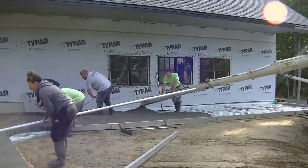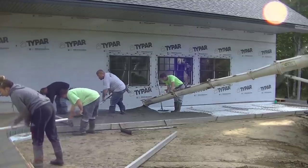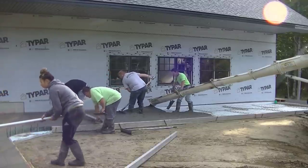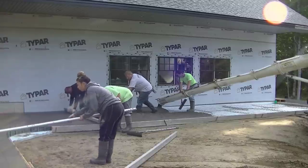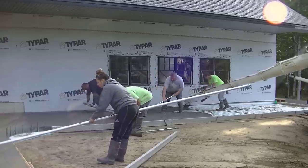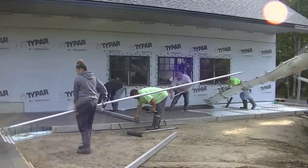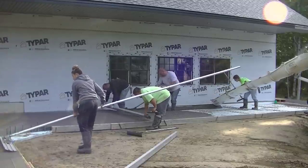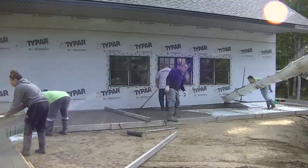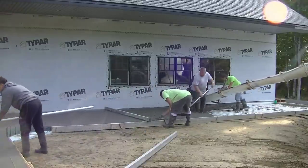Now we're coming down the side of the garage — it's about 10 feet out from the garage on the patio area over here, and the garage was 40 feet deep, so it's a pretty good section all on its own. You can see that curve to the left; we used landscape edging for that piece — it was a pretty sharp curve — and we pounded in metal stakes about every six to eight inches to keep the curve nice and rounded.